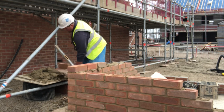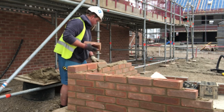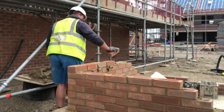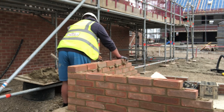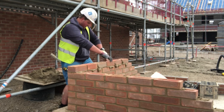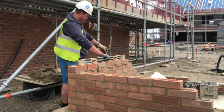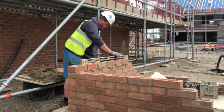All self-jointed, everything like that. Normally with my old man, my mentality behind building corners is — if my old man's with me, I'll start building a corner. It only takes like one big stack of bricks to start building. Then my old man will just wander around the garage and start loading the rest of it out. By the time an hour's passed and I've built a corner, he should have loaded about a pack of bricks out. Then he'll start jointing up and I'll move on to building the next corner. By the time he's jointed that corner, I've more or less built a second one. So then we joint up together and go for a snap. It speeds it up quite a bit — just taking away the jointing aspect takes some time in itself.